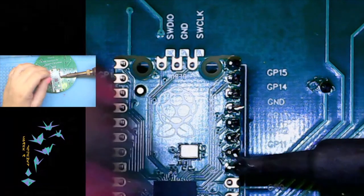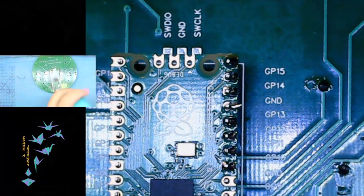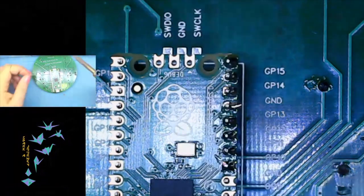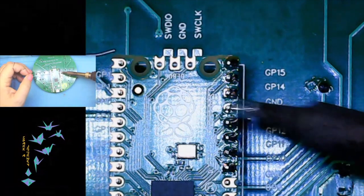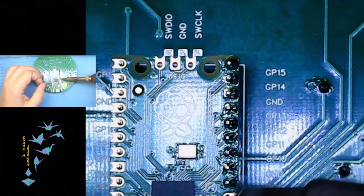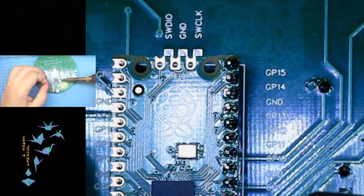And also when it comes to these final sets of pins, it's not just you. They are a little more difficult than the ones we have been working on. So just take your time and be patient. If you have soldered before or are doing this with a parent who maybe has a lot of soldering equipment, ask them for some flux. It'll definitely help.